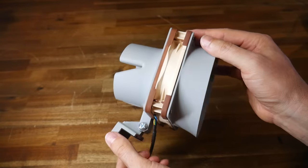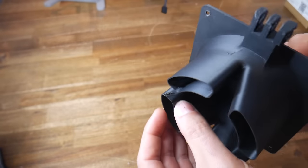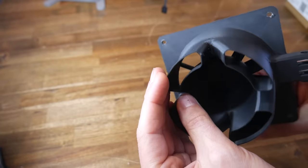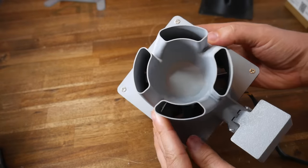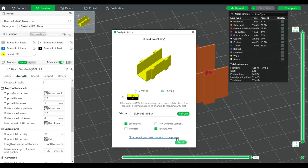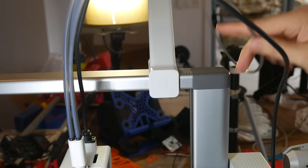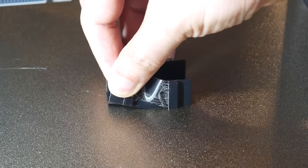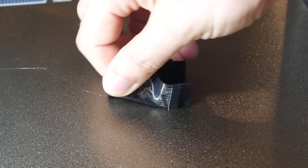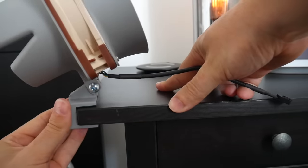So I switched to this desk fan design by Dimitro, substituting in some remixed parts from Analogic Paradox, and I actually designed my own remixed base to clamp onto the edge of the table rather than sitting on top. Overall this print is very clean, and probably the most prominent artifacts come from the Z seams where the layer changes. I did however at one stage accidentally print a shroud from black instead of grey, and it had all of these strange artifacts — big bits of filament caught on the surface — but the reprint in grey was flawless. One part of my design was TPU, which I managed to load into the AMS but the slicer denied me, so instead I assembled the optional external spool holder and the A1 had no trouble printing it at a decent pace.